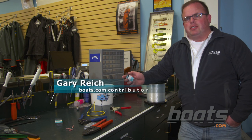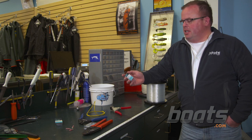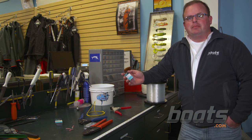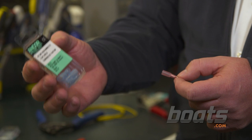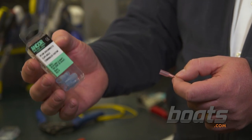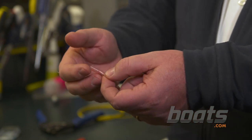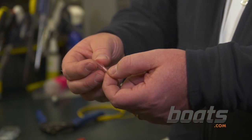There's no hard and fast rule that you have to use heat shrink terminals on your wiring on your boat, but we all know that they help prevent failure and corrosion. A regular terminal can be used anywhere where water isn't going to get, but if it's wet you'll want to use a heat shrink terminal — it's lined and when you melt it down it seals out the water.